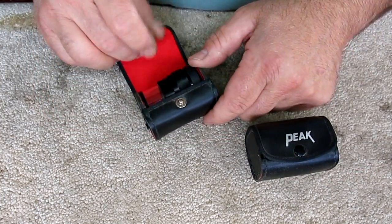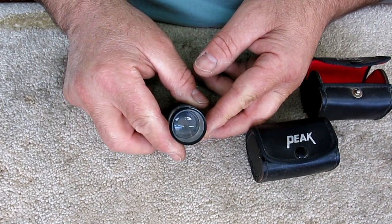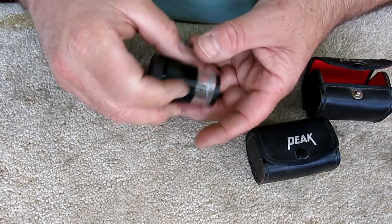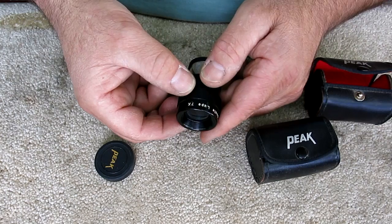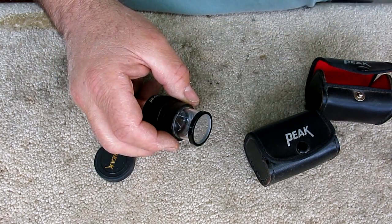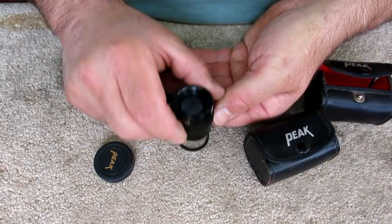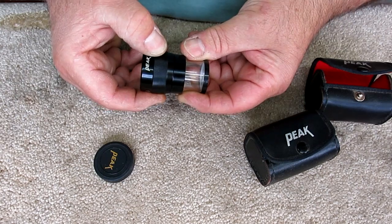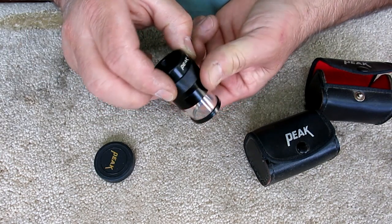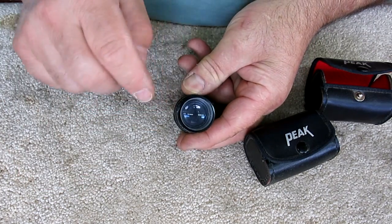These are little pocket microscopes. I don't know if you can see it there, I'll move it around a little bit, but these have a little reticle on them. And so you can focus these. It's 7x power. You can actually take measurements of objects that you set these on, okay? This helps set the focal length, and then you just focus it for your eye. Then you can actually take some measurements through the thing. So that one's got a linear scale on it.